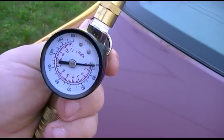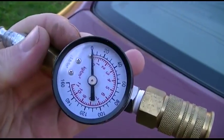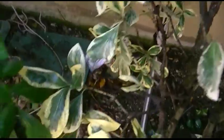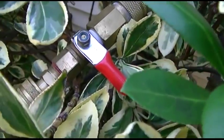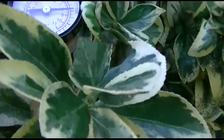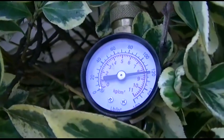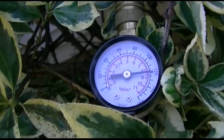Because my air compressor is located in the garage, away from where I'm going to be, I have an inline regulator here. I leave it set to full pressure, but I like to just have it there for a visual indication of what's going on. Now some people like to do this at 50 psi, some at 30 psi. Other people say you're crazy doing it at 120 psi — you're going to explode the lines in the ground. But I like to make sure I get all the water out, so I go full pressure. It's only going to be top pressure for just a moment, and I've been doing it this way for several years without any problems.